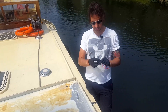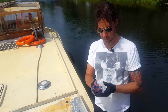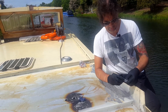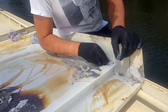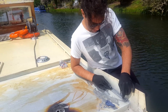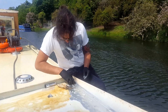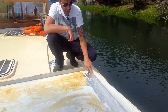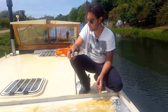It says you can just twist a bit off and then start kneading it. I'm going to put it inside a plastic bag to do it because it's fairly nasty on your hands. I think that's pretty good. It says that after an hour you can drill, tap or machine this stuff. You've got three to four minutes to work with it before it starts to go — it's a bit tricky. It got too hard to work with, so I'm going to wait for this to set and see what it's like and whether it's giving me the finish that I want. It looks like it will — it's pretty fine.